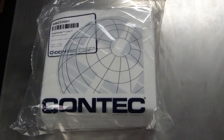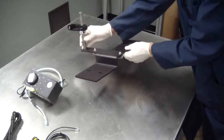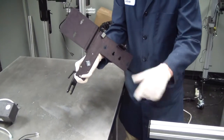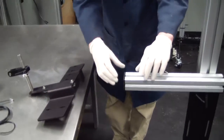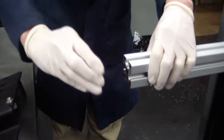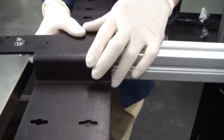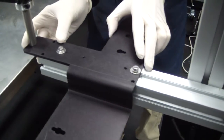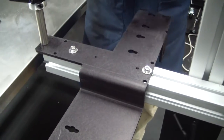Assembling the printer system requires very few tools. Install the mounting bracket on the printer stand. Notice there are T-bolts located on the bottom of the mounting bracket and a printhead mounting arm located on the printhead mounting post. Next, remove the end cap from the extrusion on the printhead stand. Gently slide the T-bolts into the channel and position the mounting bracket. When positioned, tighten the allen bolts.